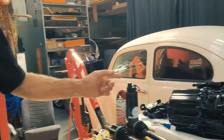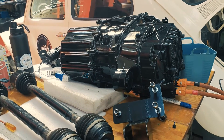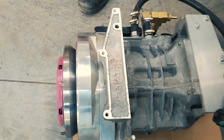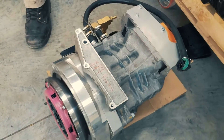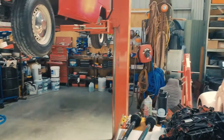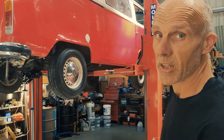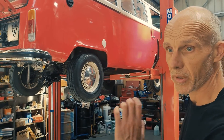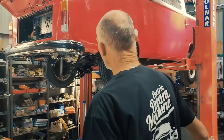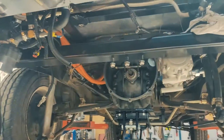So yeah, much nicer in that way as well. A little bit lighter because we're losing the gearbox. This motor is about 90-something kilos, so probably with the cradle and everything a little bit over 100 kilos. And that's basically what the original motor setup was with our adapter plate - that was 54 kilos, and with the adapter she was 86 kilos, plus the gearbox - haven't weighed that yet but it'll be a little bit lighter overall. We've got a few other things to change: the cooling system - the radiator mounts will need to be changed - and we don't have our rear engine mount anymore from the Nissan loader, so we'll have to work on that too. Our cooling pumps and air conditioner will need new plumbing as well.